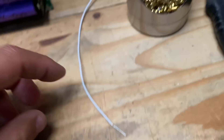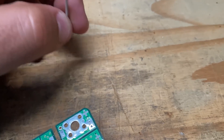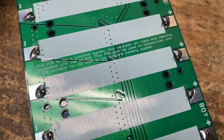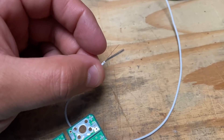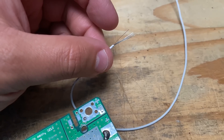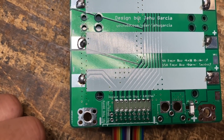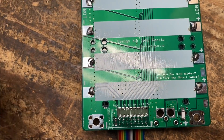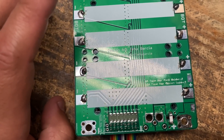A bit of a hack, as with everything I do — I like DIY stuff, this entire project is DIY. On this one I just like to take a regular cable, like a 20 gauge wire, take one strand from in there, use that, and then test it out and see if it works. I haven't done many of these, but I'm going to say it's going to be okay — about equivalent. When I tested these, they would break around 10 amps, which is kind of amazing for such a small little trace. So let's do that. I'm going to prepare this thing, put the camera down, take the batteries out, disconnect all the stuff, put the little wire there, and show you me soldering it, then put this back together and use this board just like a regular one.